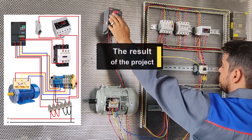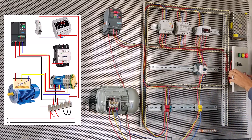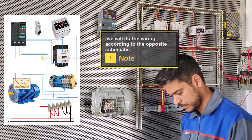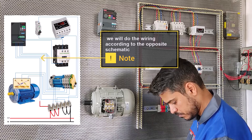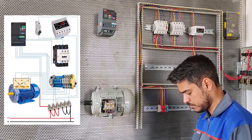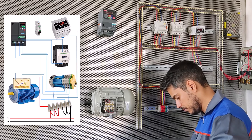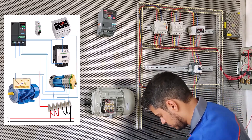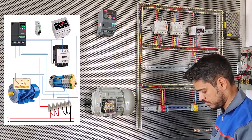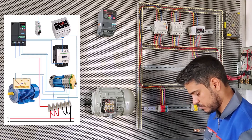In this video we want to explain how to start a three-phase motor with single-phase electricity. We want to use a single-phase to three-phase inverter and run it on the motor that we wired directly. We do this because we don't have three-phase electricity, and we want to create a three-phase electricity simulator. For incoming electricity we use a terminal and built a bridge.